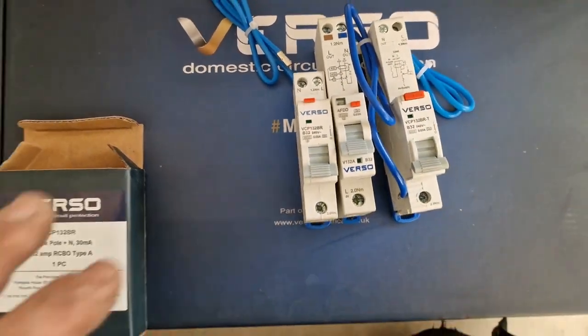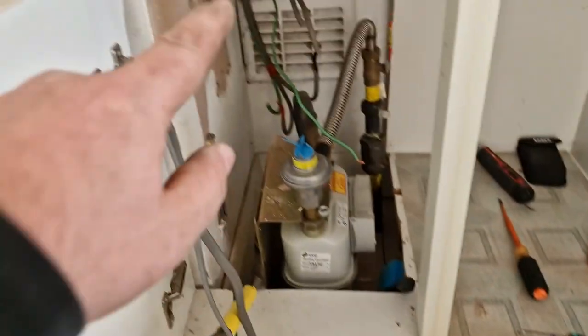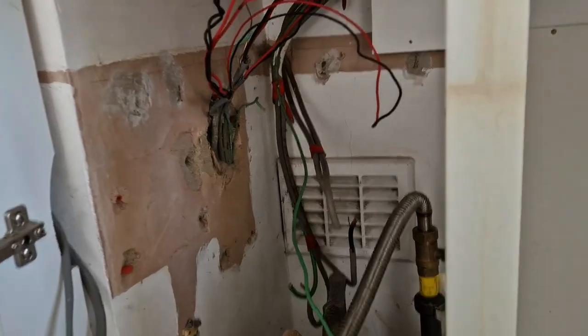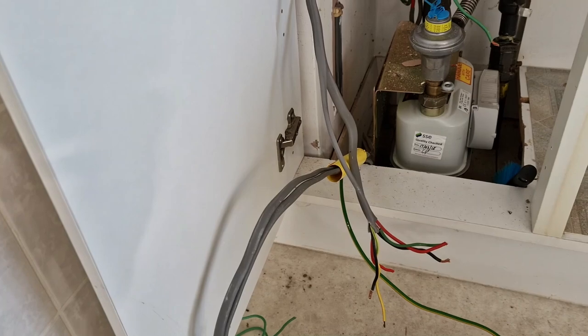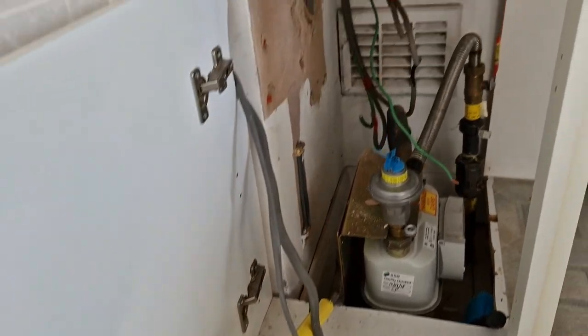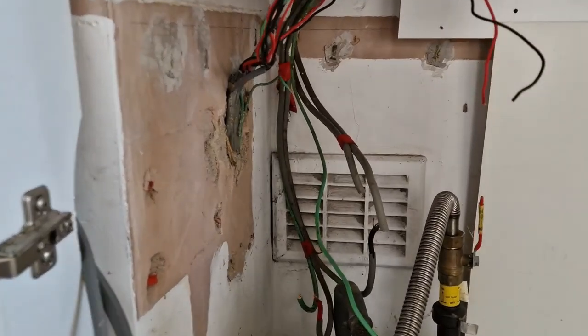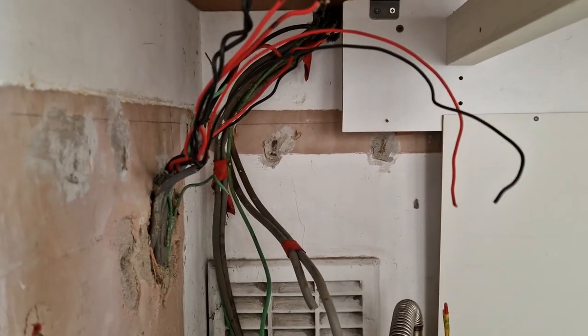This one's B32 but we're going to get this dressed into the board. We'll stick it on the wall in the cabinet, draw some new tails through to outside. I've managed to get a little bit of length but that's about as much as I can get away with. I've got these other cables coming in from different directions so we're going to have a bit of fun dressing everything into this board, but we'll make a neat tidy job of it.